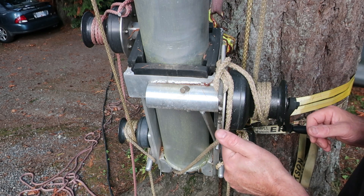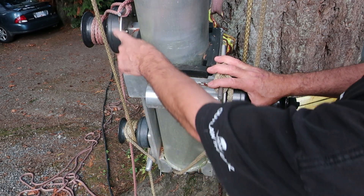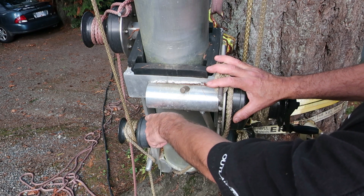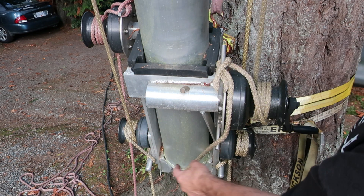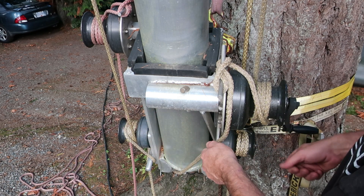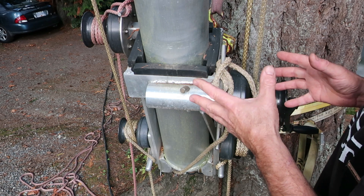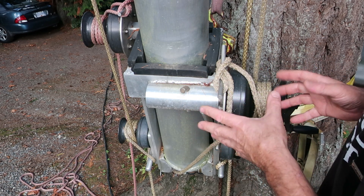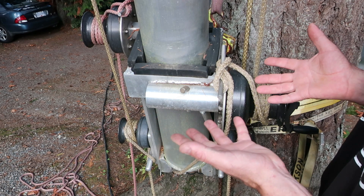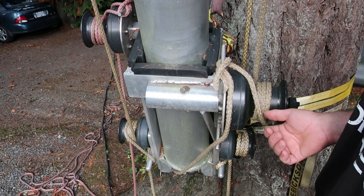Even when you're lifting something, you can check to make sure you're not kinking or twisting. It's very important that there's no damage or side loading to the actual mast or boom. This is your main lifting line — that's for lifting and raising the boom. That is for slewing right, and this is your slewing-left winch. You've got to loosen off one to tighten up the other to slew back and forth. It doesn't weigh much — I don't think this weighs a hundred pounds; it's just one-eighth of an inch thick.